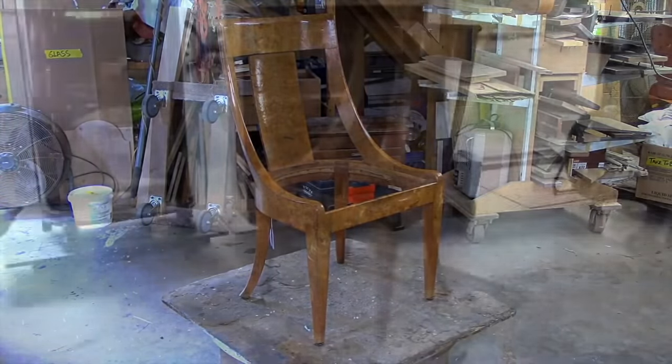I realize now I'm going to do this in two stages. I've been cutting the lower part of the leg here, and it's nice and level, even though you need to go a little deeper there. But the upper part of the break, I can go a lot shallower, so I'm going to do this in two or maybe even three stages. I finished up the first cut, and now I've got to switch to a shorter router bit. I'm going to step this up even a third time. It'll really minimize the amount of material I'm taking away.